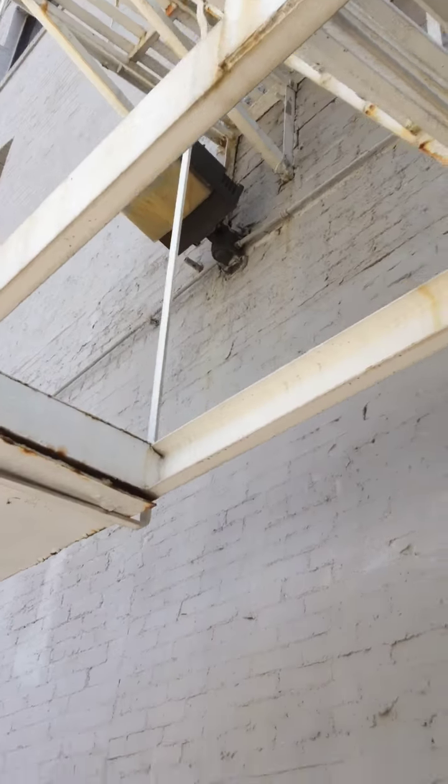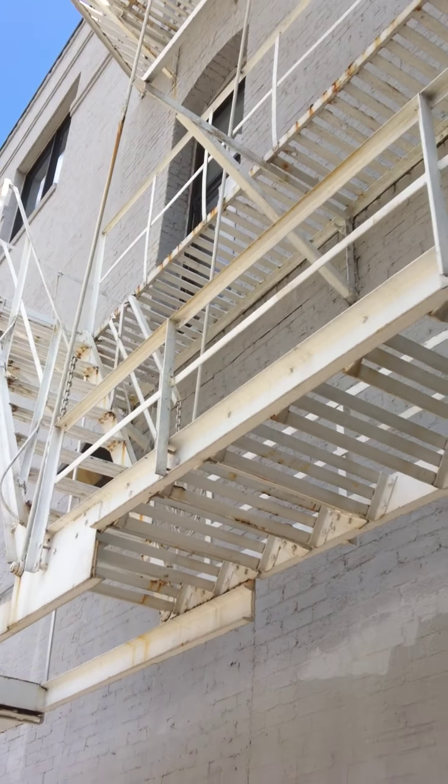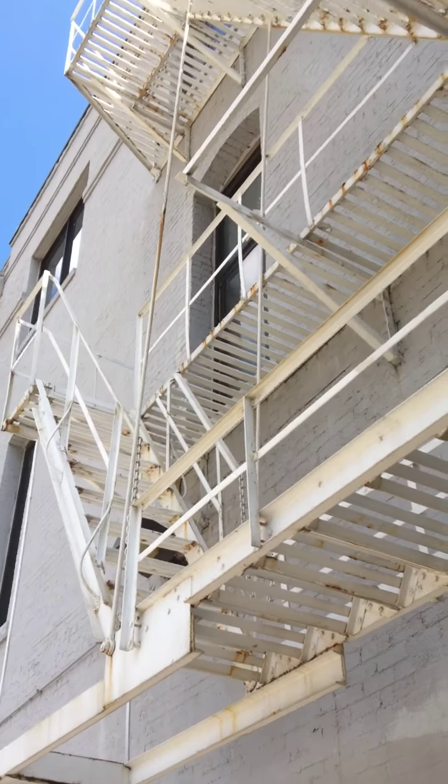So it needs a release arm because right now this thing is counterbalanced backwards because you have to come out and step on it in order to make it drop, and it won't stay down, it'll go right back up, and a fireman can't reach up with his hands and get this. So fire escapes have to be single action with a release arm. Once released, it drops 2 to 3 feet per second, hits the ground and stays down so people can evacuate.